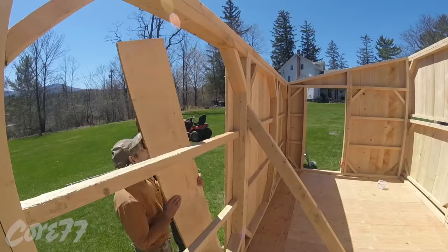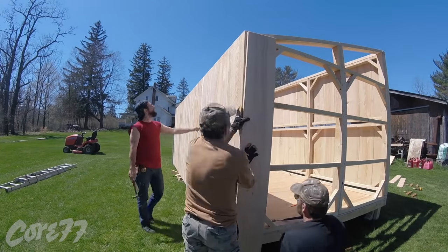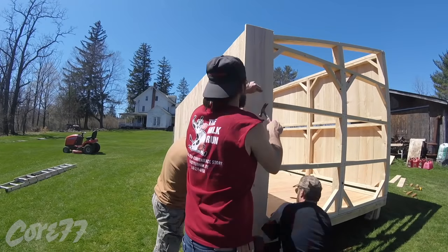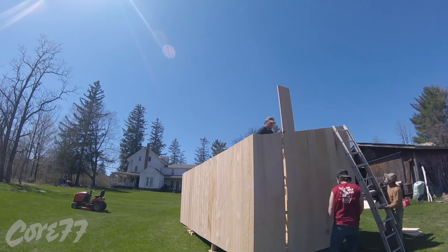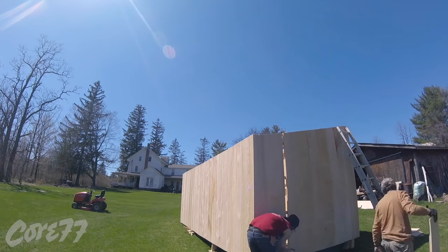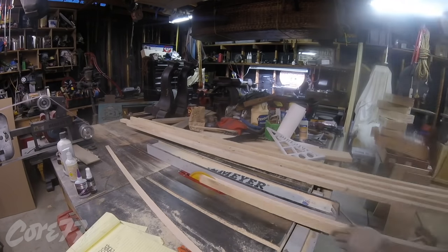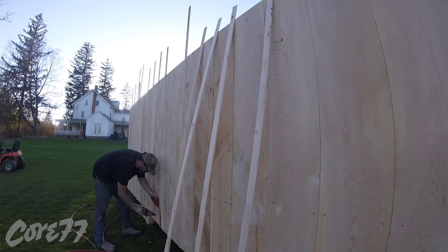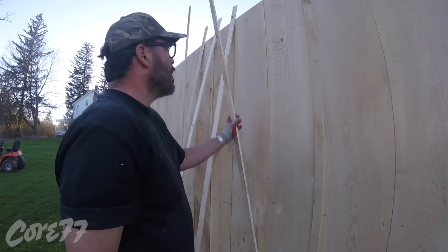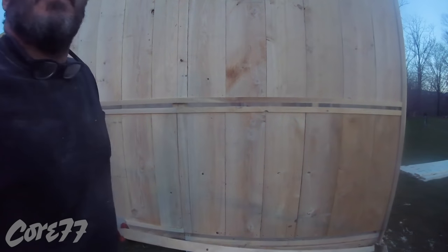Just sheeting aside — we're going to get a batten on there too. So these are the boards and the batten covers the joint. This is about noon on day two of the full build in the backyard. Cutting the boards — and just another cool drone shot, Dave's got the DJI Phantom. Now I'm cutting the battens, which are the individual pieces that are going to cover every one of those seams. You see me nailing them in place using an air nailer. I've got to remember where we're going to take apart, so I'll leave those battens off and put them in place at the site. Just framing out the front — this is going to get a bunch of colors, and the client's assistants are going to paint that.